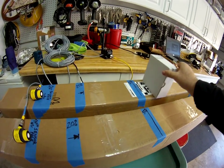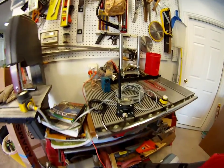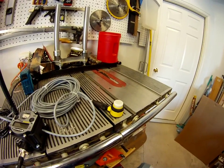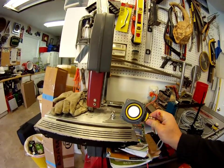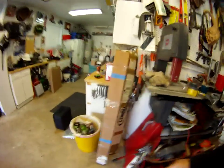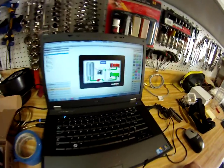As the tank level drops, we will turn on a pump which happens to be out in the country. The pump will be represented by this application here with a wireless node. We're going to use this LED here to simulate the relay which would then fire the pump. There would be a tank connected to this ultrasonic giving us tank measurements, and inside the plant we're going to need to call to turn on the pump.